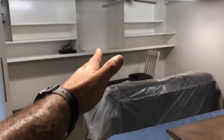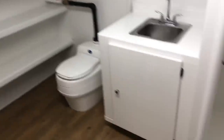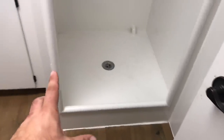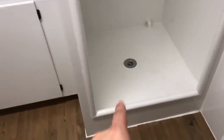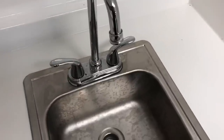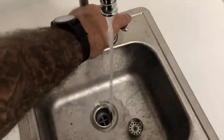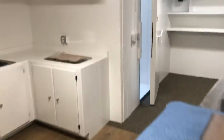This is your bathroom. Shower head, faucet, water adjustment — all the water in this unit runs to this tank. It will fill up; you run this switch and that is a lift pump that sucks all the water out of this tank and pumps it up and out to the surface, into that drain that runs off the side of the bank. We've got water here as well — let me go turn the water pump back on so we get water pressure.